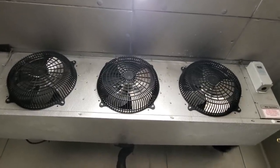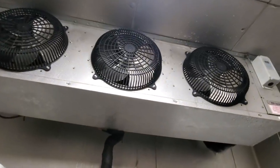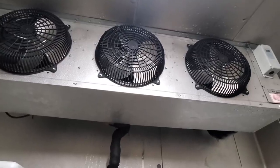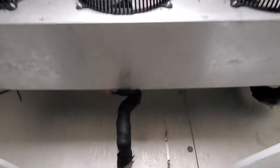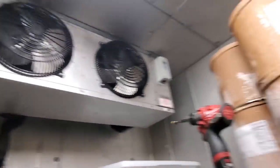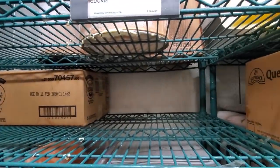Today we have a walk-in freezer evaporator that is not working. The complaint was that they have soft ice cream, and yeah, that's the case because ice cream is dripping everywhere. What I found back in here is that we've got a freeze-up problem, but the freeze-up problem is a little peculiar, kind of indicative of a TXV problem. But we will see. I gotta get it defrosted and then we'll further test everything. You see, I've literally got ice cream dripping out the bottom of their thing.